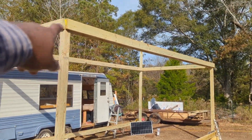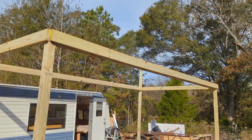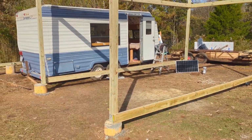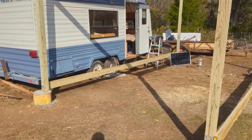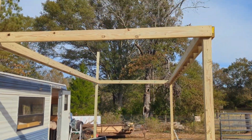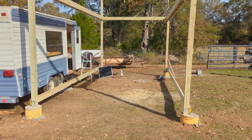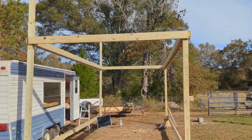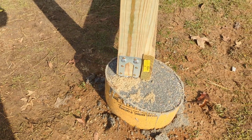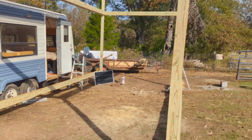Like I said, I didn't expect to make a second story, but now that I'm making a second story, I'm gonna come in and brace these poles up. Like I say, they're solid enough to where they're not gonna move, but I do want to add in some extra support, which I plan on doing. But I'm gonna focus on getting the first floor, getting the floor joists put in, to tie this board and this board together, because that's the main thing right now, is tying everything together, so that it takes away that little bit of wobble and makes it structurally sound, to where the wind won't just come and blow it down in the middle of the build. But it's solid. Those brackets there aren't going anywhere. They're set down deep into the concrete, and they're lagged down, torqued down good. So I'm gonna work today on getting these floor joists in.